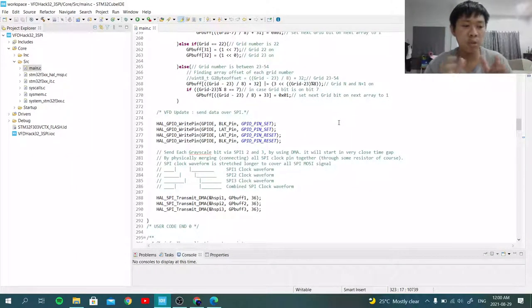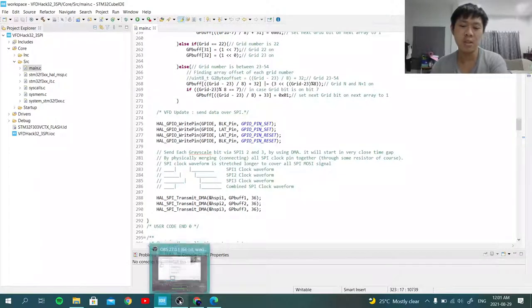I need to think how to make the frame buffer array to store 3 bits for each pixel. And it's not standard. Most displays I've seen have 4 colors, which uses 2 bits, and 16 colors uses 4 bits. It's multiples of 2, there's no 3 bits. So this thing is kind of weird. This display is just a weird thing from JDI. You know, JDI likes to make some weird things, but that weird thing is really cool, isn't it?